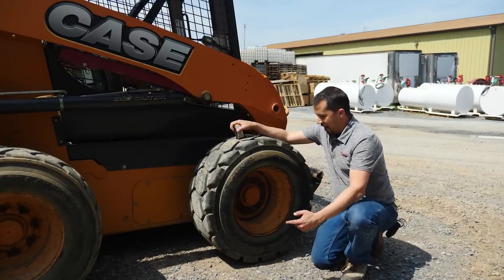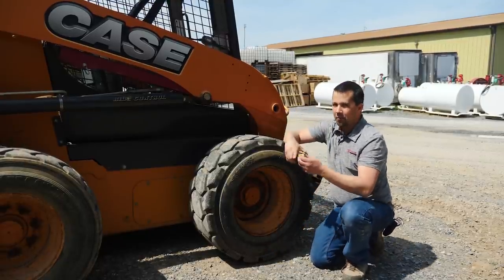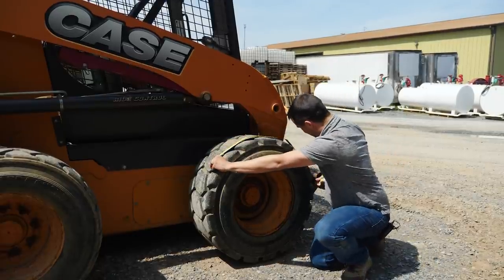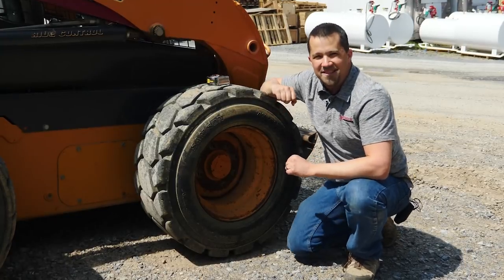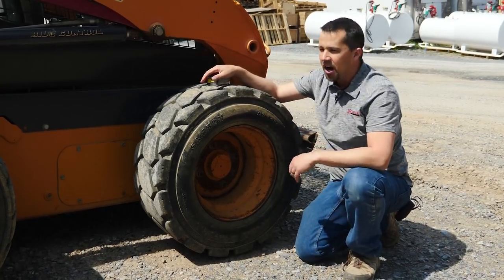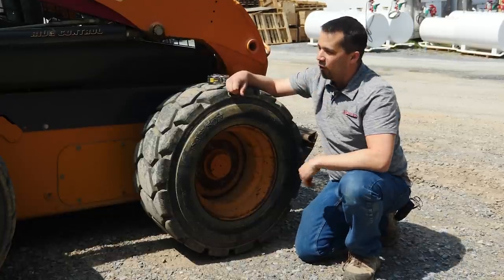And that's going to all stem from something called rolling radius of your tire. The rolling radius of a tire is going to be the diameter around the outside of the tire. I brought this out here to be able to measure it for you and show you how it works out, but this inflexible tape measure is not contouring the tire very well. The problem that we see happen with skid steer tires is in that rolling radius — the circumference around the outside of the tire for which that tire is going to turn as it travels forward.